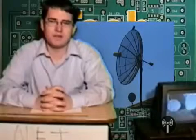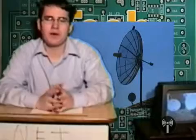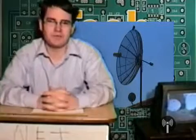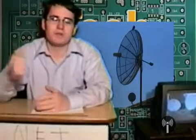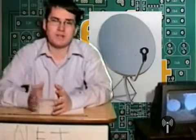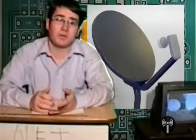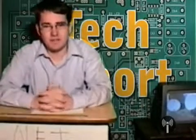There are C-band dishes, and these are designed to receive the lower frequencies used in earlier times. There is still a lot of programming on C-band; however, it requires a five-foot or larger dish, so many residential neighborhoods wouldn't approve of a huge dish in your backyard. Most programming is switching over to a newer system called KU-band, which requires a 33 to about a 40-inch dish, depending on what satellites you're trying to pick up — only a little bit bigger than the dish you'd get from Dish Network or Bell Express View. This dish can mount on the side of your house and be fairly inconspicuous.